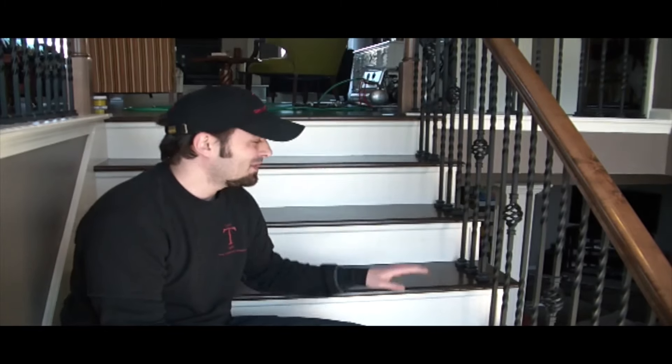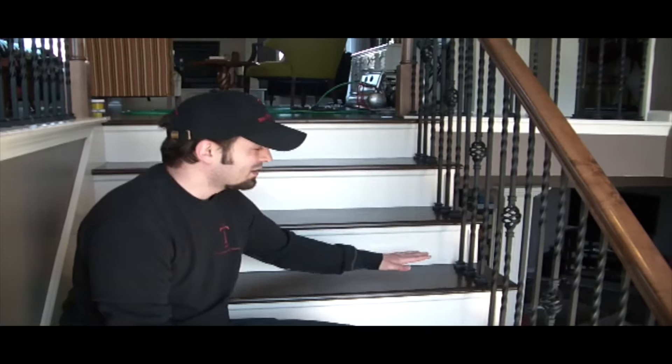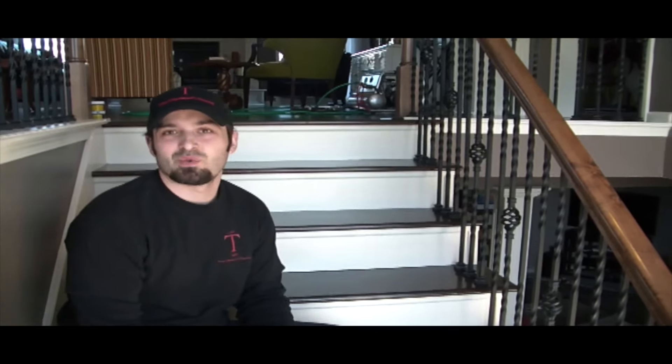We're finished with this remodel project in Kansas City, Missouri and I'm just going to walk you through real quick everything that we did. We were able to keep the main structure of these stairs so we didn't have to do a complete stair rebuild. We did keep the existing treads and risers — we just trimmed them out and we installed solid oak treads that you see, and then paint grade risers. Then we trimmed everything out with some pieces of trim just to give it a real nice finished look, caulked everything in, and it looks great.